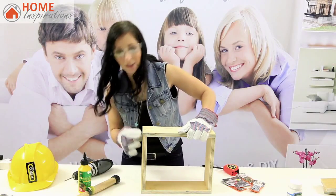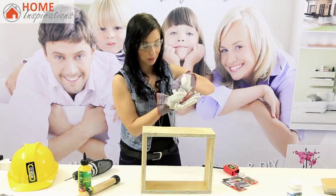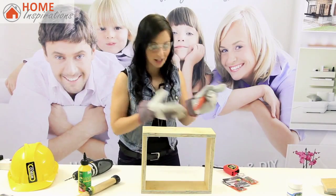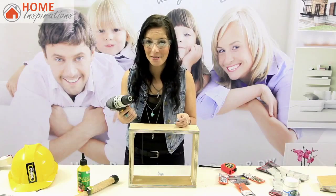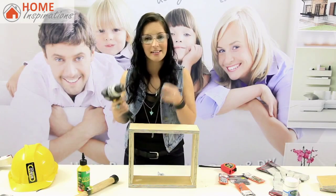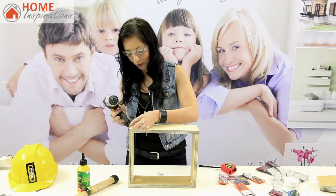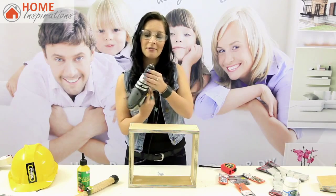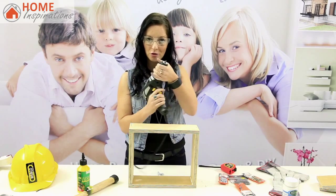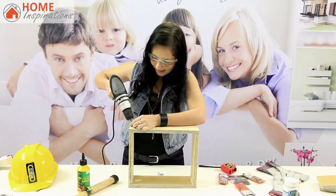The pilot holes need to go deep. We're going to put the screws in — just one on each side of our box frame. The pilot holes guide the screws in better so you don't have a wobbly screw. I've put the Phillips size 2, 25mm bit into my drill, all secured, and that's going to help screw in our wood screws.